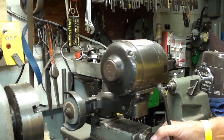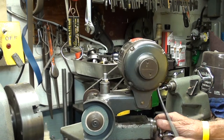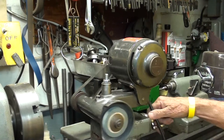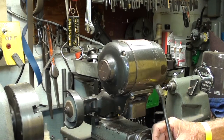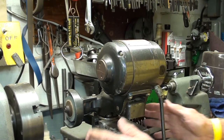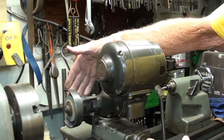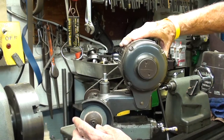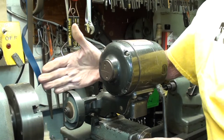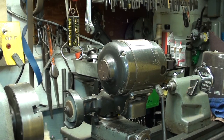I've got that mounted on the compound, and I can swing it around. I want to make sure that the shaft — or the spindle — is parallel or in alignment with the main axis of the machine. I'll tighten that down, but that's still kind of a guess. So I will dress it, and that will bring the face of the wheel in compliance with that axis. So I'm doing three or four things when I dress the wheel.